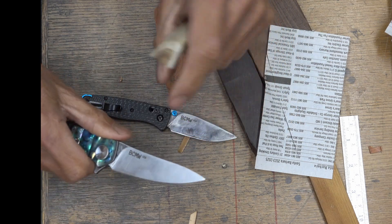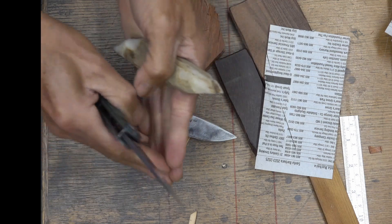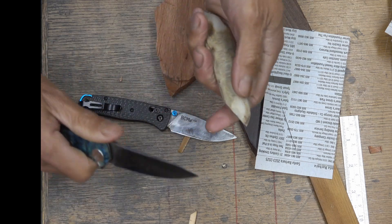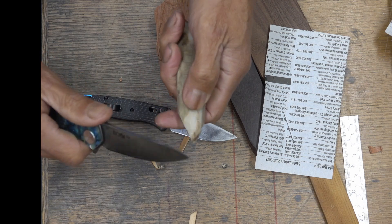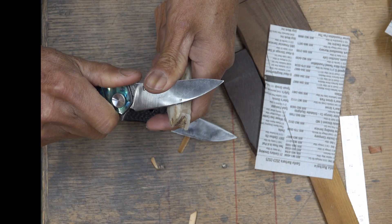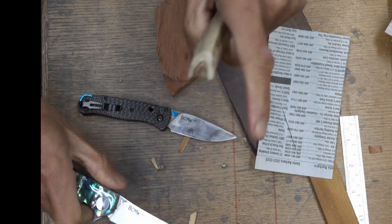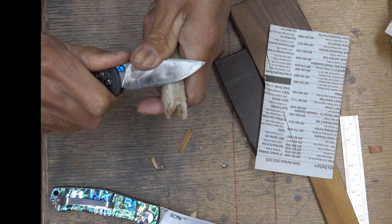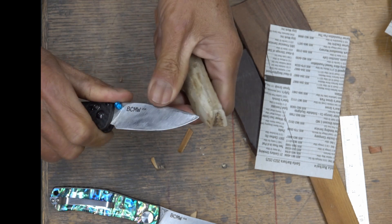This is bone — just to see whether or not this has sufficient strength to dig into it. When the edge is really thin, it won't, and it will flex upward when you try to dig into it. It needs to be a minimum, ideally about 62 Rockwell and up before it digs well. This one struggles a little bit at that hardness.